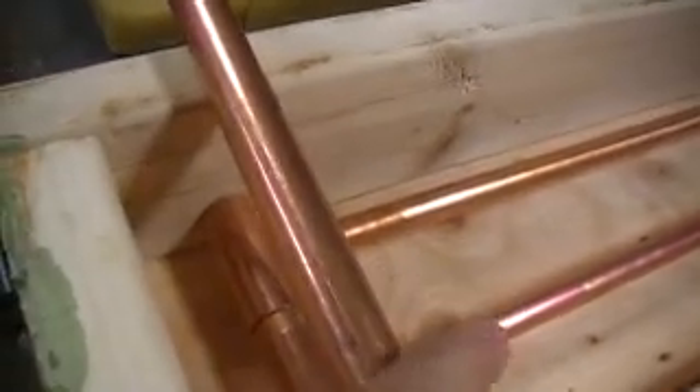This here will not be soldered because the pipe that's going to go across here will eventually be in here and go out, but I can't slide that one in, so it'll have to be slid in afterwards through the hole and up to this connection. I'll be able to lift this whole unit up and away from the insulation — I've got some fire retardant material I'll put between there — and solder that last connection. For this other end I might end up using one or two SharkBite connectors, which will eliminate some soldering really close in here. I don't want to melt my insulation.